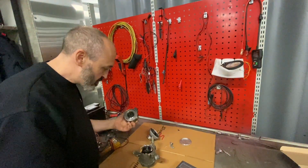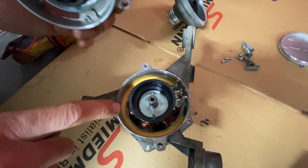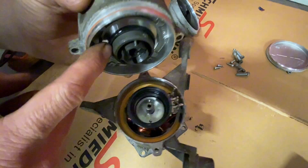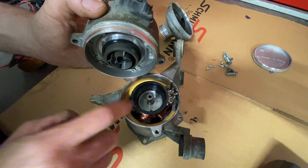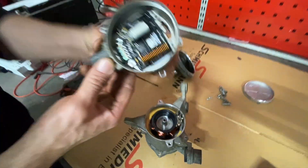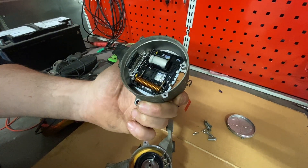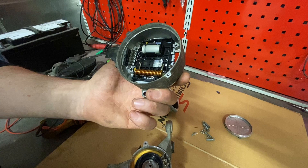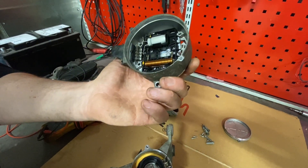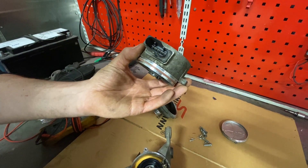The other thing that can happen — not often, but sometimes — is the seal between the pump body and the motor windings can leak. In this case it hasn't. It's okay to have a bit of coolant in the pump section, but you don't want it inside the motor. That's fine. Then you look at the evaluation electronics inside — it's quite a complex board with a big capacitor and a driver. All I can say is: you lose communication with it.